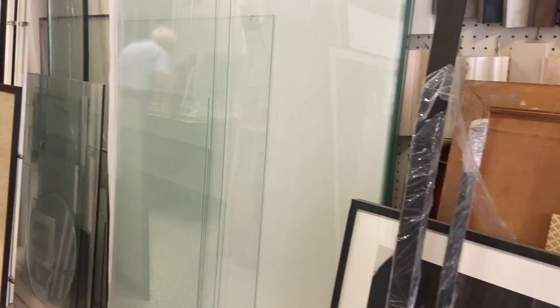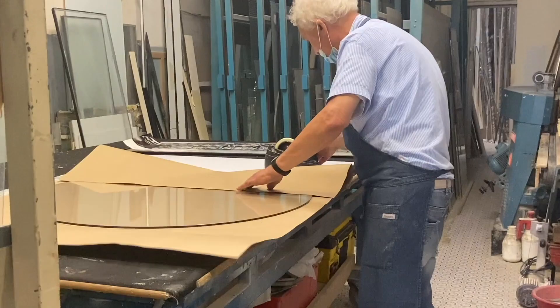Now let's talk about the glass. You have to buy one of these circle-cutting twirly tools — I bought it from Amazon and I'll leave the link below. You stick it in the middle of the glass and start turning it around to create a perfect circle. It has a tiny knife on the bottom, so while you turn it, it leaves a mark on the glass. Then, exactly as I showed in my previous video, you can bump the glass a little until it breaks apart. Option two: go to a store that will cut the glass for you if you're lazy. Either way, you end up with a circular glass top that you place on the base, and the table is done.